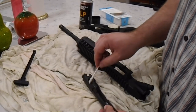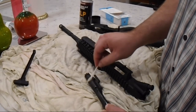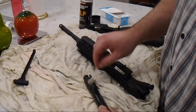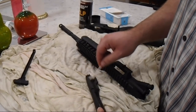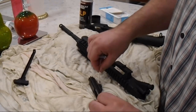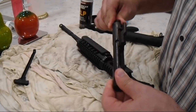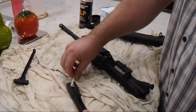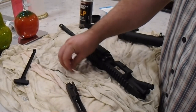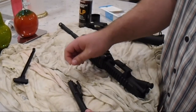Do the gas key up here as well — but not the inside, as gas actually runs through your gas key. You don't want to do the inside of the gas key, just the outside at least. Once you get to the gas tube, you do want to lubricate that due to the fact that the gas tube slams into the inside of your gas key. So you want to have the gas tube lubricated at least.